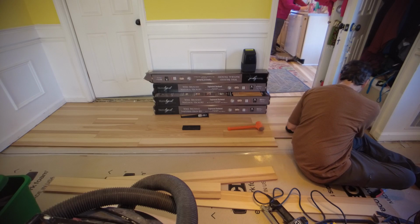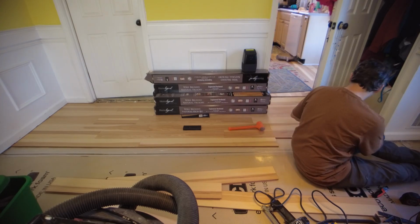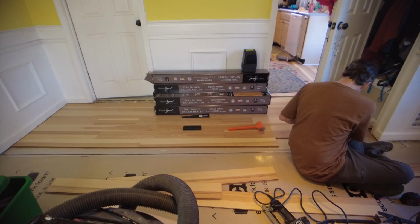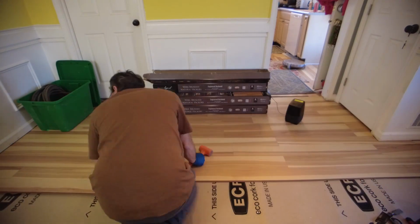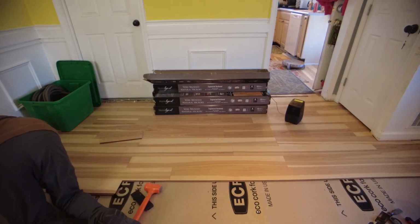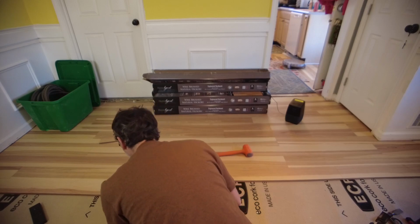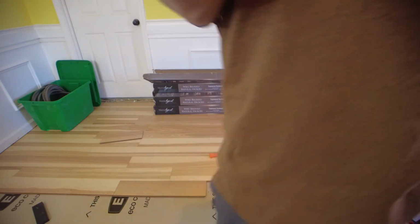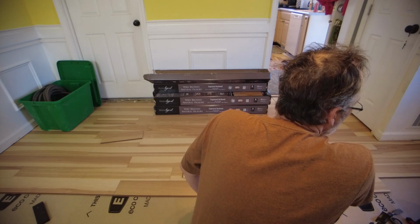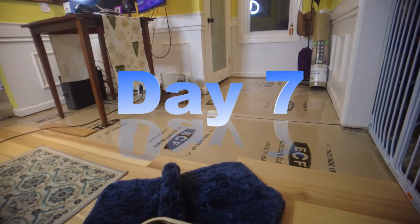They're there to sell you the floor. They don't even know how to install these floors generally. So any type of floor that you lay, put an underlayment under it. Doesn't matter if it has that foam on it or not. You need to put an underlayment under it, for one reason, for dirt to embed, and that way you don't have the sound of the crunching under your floor or squeaking, and you can deal with any inconsistencies in the level, and your floor will lock, because that's the problem. It won't lock and it won't lay if the floor gets too far off and you don't have a good underlayment under it.